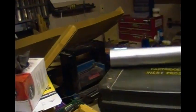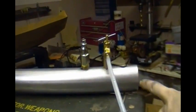Now what we've got to do is mount this in the burn tube and then try spraying some kerosene. Here is the finished product. We've got the fuel valve, the air valve, and the pipe the entire thing is now housed in. Basically, fire is going to be coming out at this end. And if need be, I can insert a vacuum nozzle or my hot air gun in this end to provide additional air. In theory, you could not only use air to atomize the kerosene — you could also hook propane up to this and it should atomize just as well, but with propane you'll definitely need additional air.